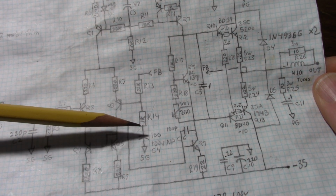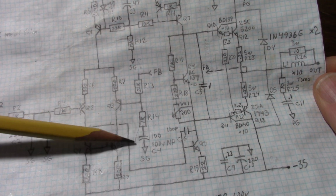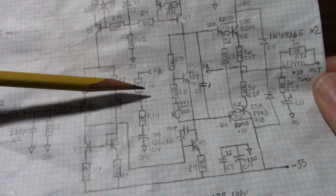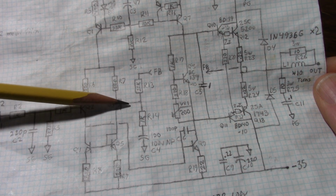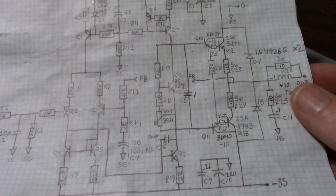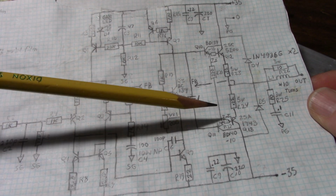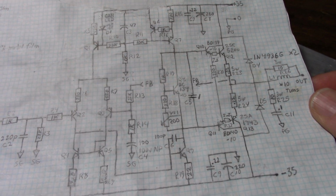Well, you can also add a second diode also in parallel with that capacitor, anti-parallel with the other diode. So if it goes positive, this will still conduct. You'll still get the voltage divider effect here, and it won't allow a high voltage to build up, which could cause a reverse conduction situation. Am I going to put those in this amplifier? I decided against it. It's just more parts. And unless something happens to this amplifier, there won't be an issue in normal operation.